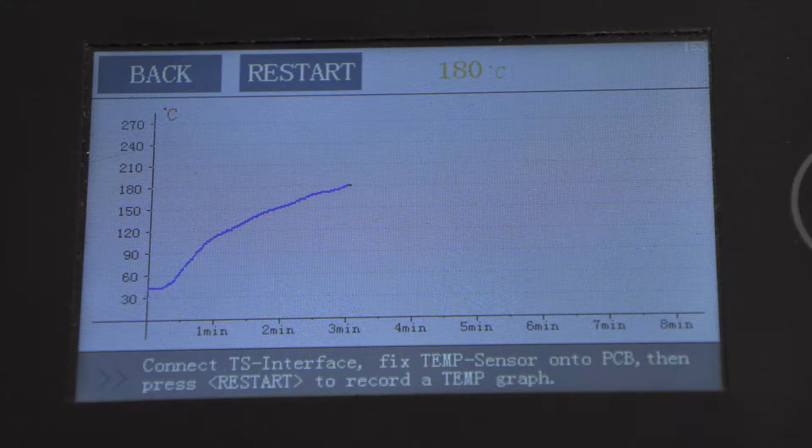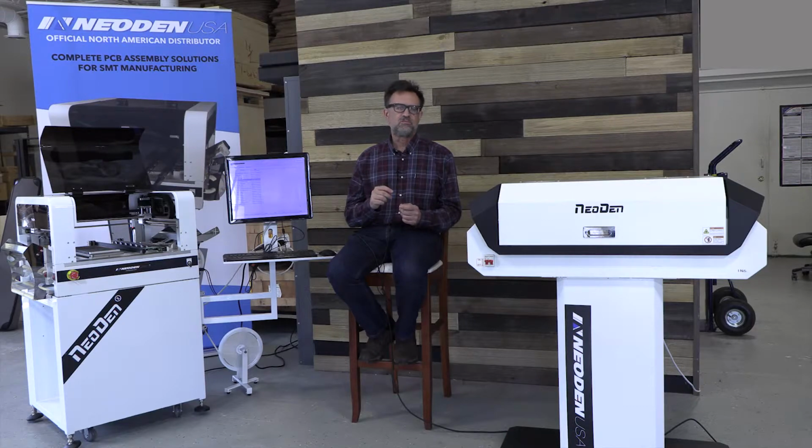The first step is called the preheat phase, and as you might imagine, the purpose of that is to heat the entire board to a temperature near where the paste wants to be, because the board acts as a heat sink. All that copper on the board will absorb heat, and it will do so according to the way your board is laid out. If you have ground planes or you're using a multi-layer board with power planes sandwiched in between, all of those planes will absorb heat and change the overall temperature profile of the board in ways that are somewhat unpredictable because all boards are different.